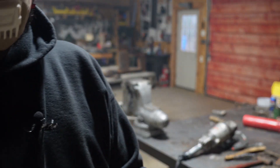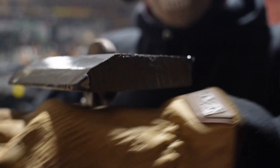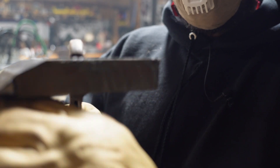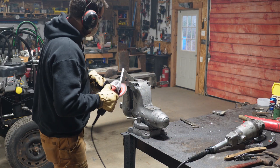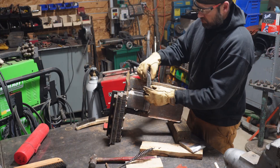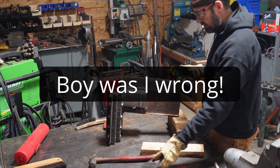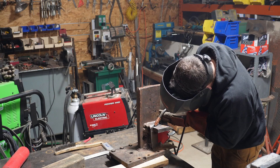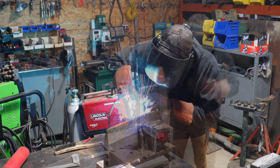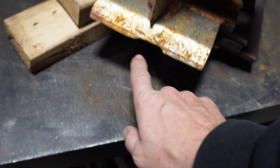One thing to note here is that I'm mostly putting the ramp of that wedge on the top so the wood will slide under it, but I don't want there to be an incline on the bottom because that will jam wood underneath between the winglet and the I-beam. So I'm putting the bulk of the wedge on the top. Now we'll use a flap disc to clean it up a little bit. If I angle it down just a smidge, I'll be able to avoid anything getting caught under there. I'm pretty confident in this. We're going to take one close look before I start tacking up. And while I have it off the unit, I'm going to go ahead and fix this too and angle it down a little bit more.